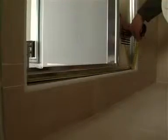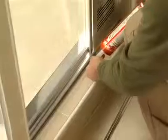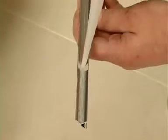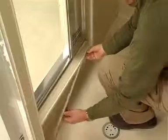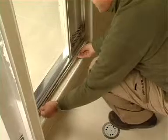In the lower internal part, we now install the drip unit, a profile which makes the water flow to the inside. In this case too, if the thickness of the covering exceeds the edge of the counterframe, it may be necessary to cut the profile to measure.